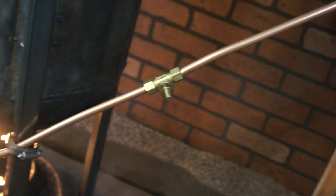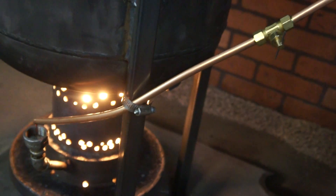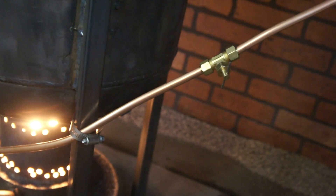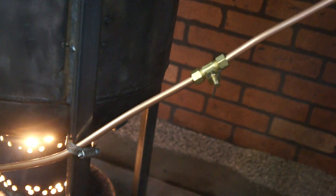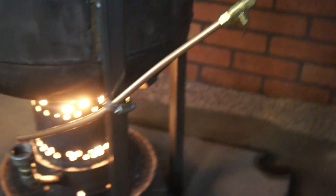Here's one change we also made: we went from our quarter-inch to our 3/8 line, and now our needle valve is down here. The 3/8 line has the ability to drain out, whereas with the quarter-inch line we could have the needle valve at the top and see immediate adjustment at the drip end. With the 3/8 you can't do that, so we moved the needle valve down here. We actually had a runover issue — we made an adjustment, didn't see anything happen, walked away, and it was too much. It filled the heater completely full and ran out on the floor. There's still a stain there from hot oil on the floor, so now we keep a little floor-dry against the back wall as a barrier.